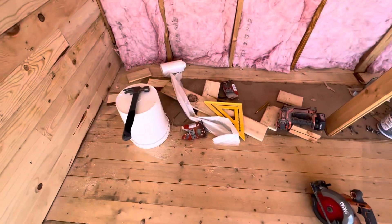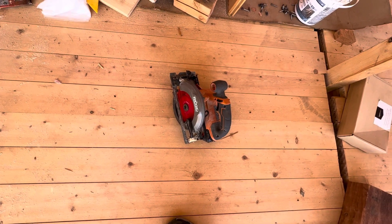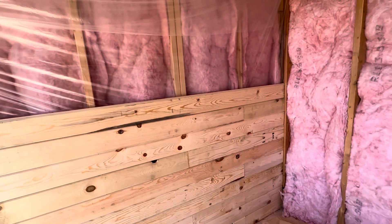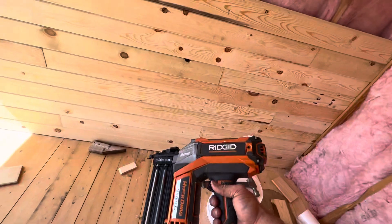On this last one, we're going eight feet to this stud here — it's not nailed in yet. I just mark it, use my square and my cordless circular saw, cut it, and put it up here. One thing you have to mind is this gap, because if your board is bowed or there's something in the way, it'll stand off.